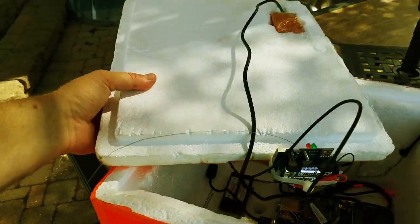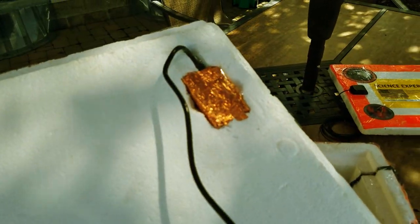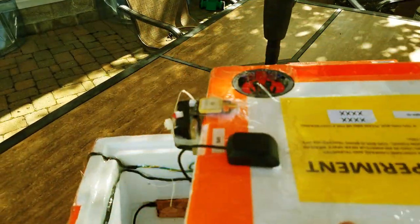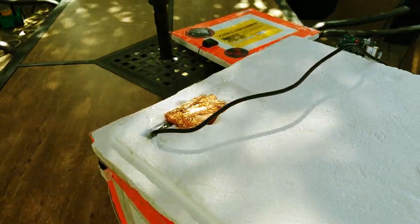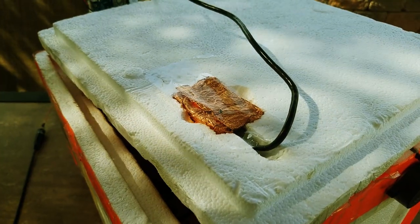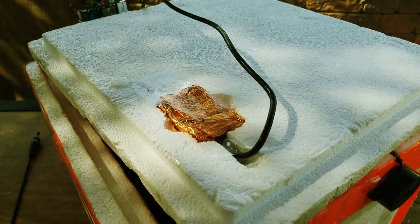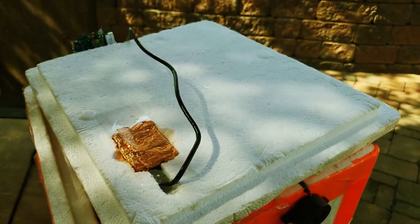So now let's take a look at the inside of the box. One of the first things you'll notice is a couple of wires sticking out — one goes to the camera, and one goes to the external GPS antenna on the outside. As you can see here, the third camera is embedded in the top of the box. Those cameras will only last for about 45 minutes with their internal battery, so we have to provide external battery power so that it will last for the entire three-hour flight.